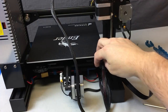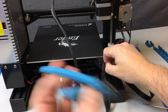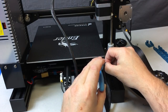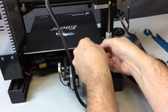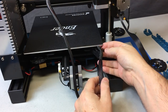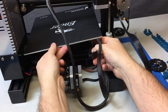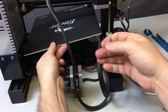Let's put some drag chains on this thing. To start with, we need to clip this zip tie that is holding the cabling to the current support arm — clip that very carefully and be careful not to slip and nick your wiring at all. Then you're going to see a small trapezoidal plastic cover on the top back. That just snaps off. Once you get that off, you're going to unscrew all four adjustment wheels from your print bed. Once those are off, you'll be able to lift your print bed freely and get the old support arm off. Your spring is going to drop free too — just set that aside.